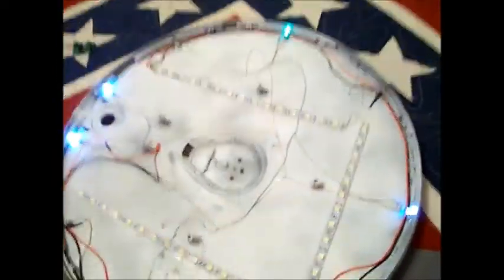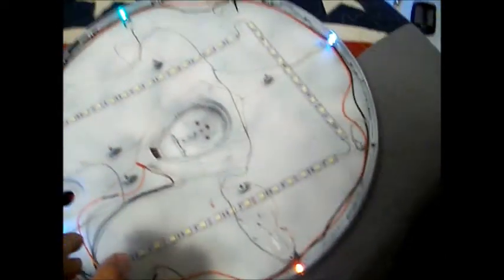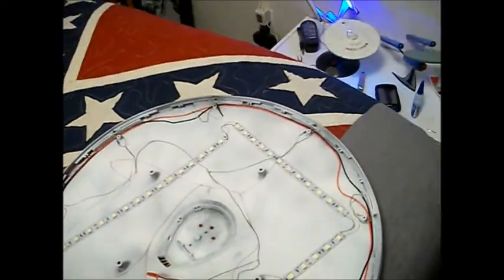I soldered a component wrong. That little strobe on the bottom — the Tenet Controls navigation strobe board requires the resistors to be on the negative side, but I wasn't paying attention and the resistor is soldered on the positive side. So I simply disconnected it and it's just not going to light up, which is fine. I had all these soldered on the positive side too, but I went back and changed them all so now they're right.